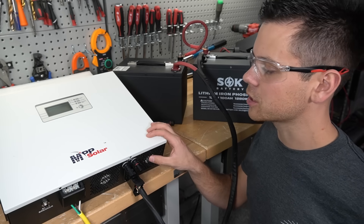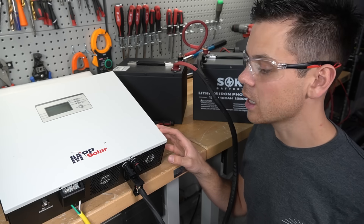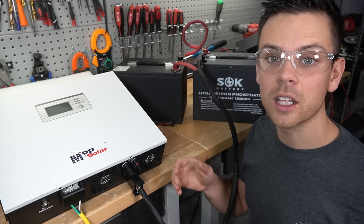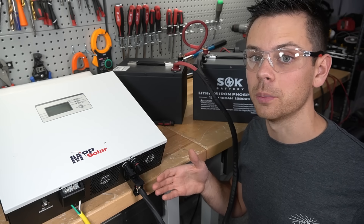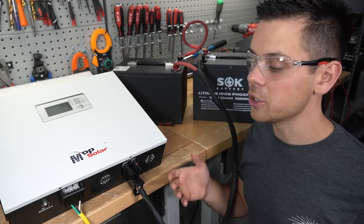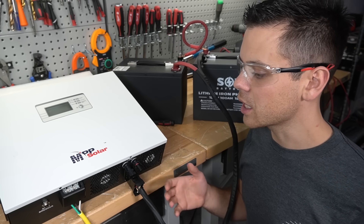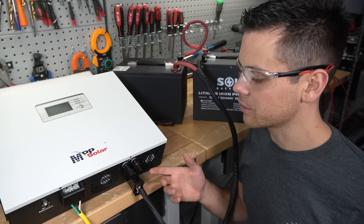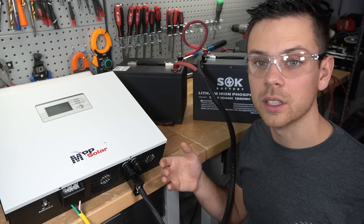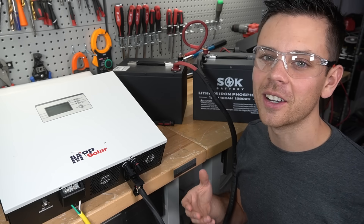That's all the downsides I can think of for this power box system. This is very beginner friendly and game changing in my opinion. It's cheaper than those solar generators and you can use any battery you wish. If you want to save a ton of money, buy the server rack 24-volt batteries, put them in parallel, and connect them to this box — you'd be up and running in less than an hour with a seriously powerful system. These are sold through Watts 24/7, a distributor for these inverter boxes, so I'll have an affiliate link below. Thank you for watching and I'll talk to you in the next video.